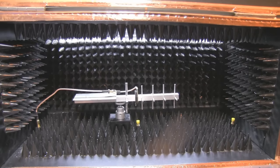I'm definitely going to take some of the methods I've used learning to build this to build a slightly bigger one. I also think I'm going to go down the road next time of using some foam and mixing up some graphite and carbon into a paste using a clear acrylic varnish, and try to impregnate the foam with that to create the tiles and cones — just like they do in a traditional anechoic chamber with impregnated foam, rather than the solid epoxy I've used here. It might be a little bit easier and less time consuming. Please give the video a thumbs up and drop any questions or comments below, and hopefully I'll see you on the next one.